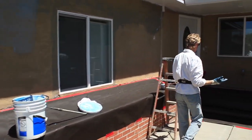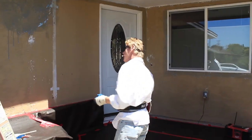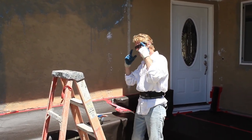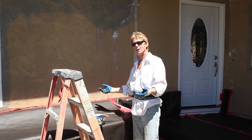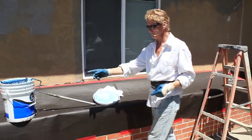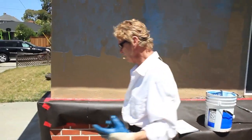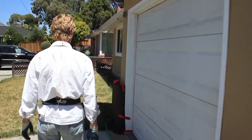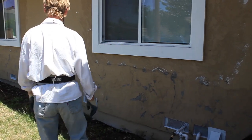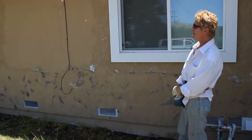Color consistency is the most important thing. Another thing we do is improvise a lot — that's what plastering and most trades are about. I'll go around and cut in everywhere, and if I see things I'll correct them. Common sense says cover the brick before you apply the Weld-Crete, otherwise it gets everywhere and adheres where you don't want it. We had said we were going to do one thing, but oftentimes I'll look at a job and change my mind and go a different route — that's normal.